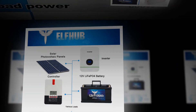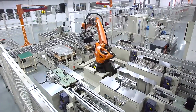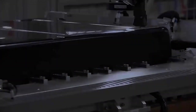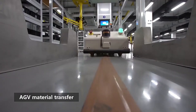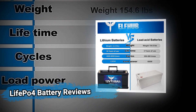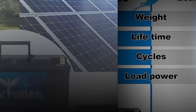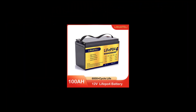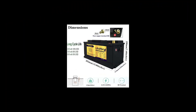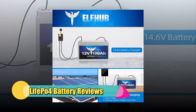For instance, as a battery low-voltage monitor. The TL431 is fine as a switch, but it thrives on feedback. To make a voltage regulator from the LED circuit shown here, all you need to do is add a transistor in place of the LED. Have the TL431 turn the transistor on when the voltage drops below a target voltage, and off when the voltage rises above. Indeed, this cheap and cheerful voltage regulator application is where almost all of the TL431s end up — providing voltage regulation in switching power supplies.